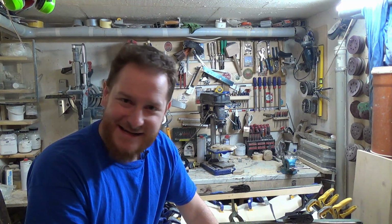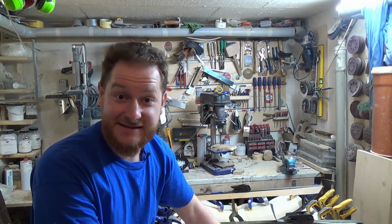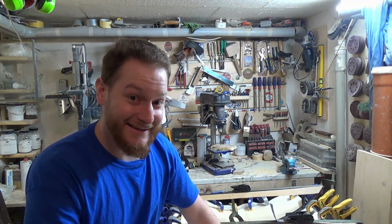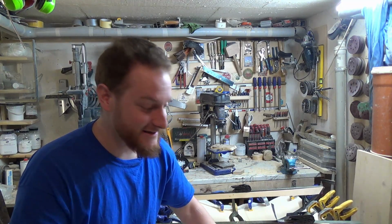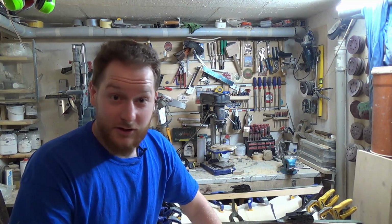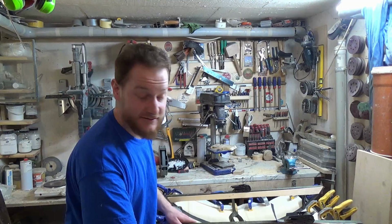The shield's gonna be massive. I think I'll leave the plywood in this position for 7 days, maybe 10 days. Because till the glue in the center has dried, it will take some time. And in addition, the longer the plywood stays in this position, the less it will deform back. So that's actually quite a good thing, to be a bit patient. Which I'm normally not, but well, one has to learn, so let me just carry that into another room.